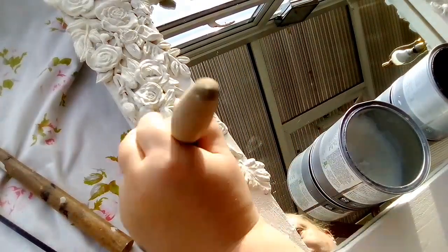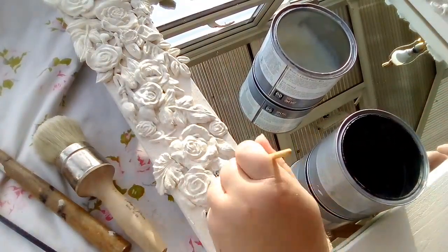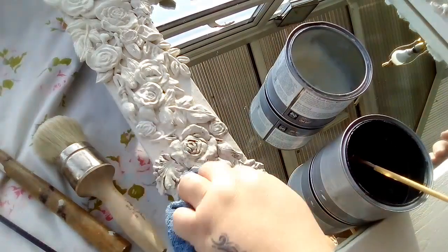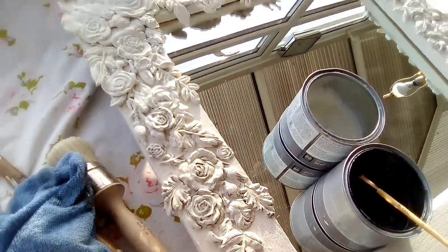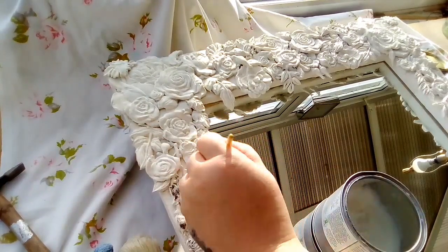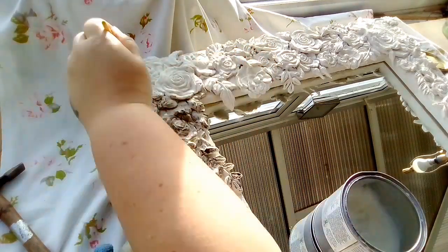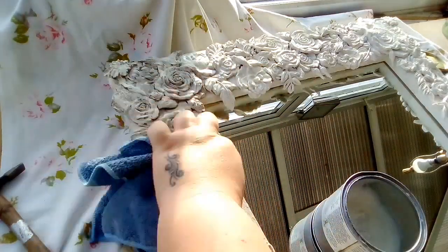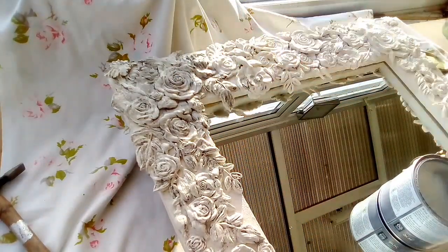A few hours later I've now attached the mirror to it and I'm using the Annie Sloan clear wax and black wax. I'm going over it with my Annie Sloan wax brush and then just a little makeup brush for the black, and a damp microfiber towel. I pop on the clear wax first to give it a base, then add in the black and take back any excess with the cloth. You can have it as heavy or as light as you like, but I do like this — it takes it from looking nice to really standing out. It's going in my hallway so I thought white and black should blend with everything else.